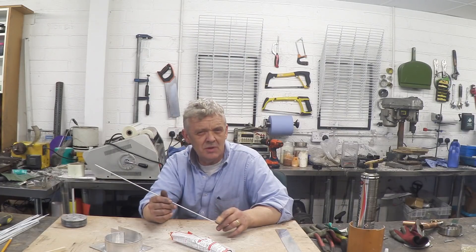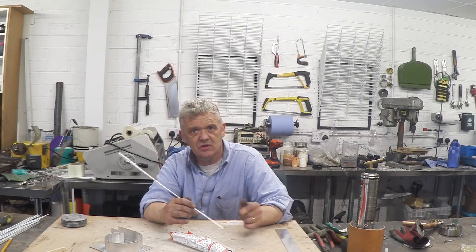You have to get it up to heat. I used wood to hold it because if you clamp it with too much metal it takes ages — four or five minutes — to heat up. Using wood, it took about a minute or two to get hot enough for the rod to flow. Initially I was too close to the flame. Later, when the welds got better, I would heat the metal and then run the rod across it without the flame on it — it would only run when the metal was hot enough, and that makes a better bond. It's a bit like soldering, but rather than heating the metal and running solder into the heat, here you heat the metal, take the heat away, then rub the rod on. It is a mechanical bond, so you do need to rub it a little — it doesn't flow the same way solder flows; you've got to give it a pass over and smudge it around to get it in there. But nothing special about the equipment — a completely standard torch and it worked really well.